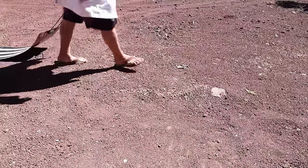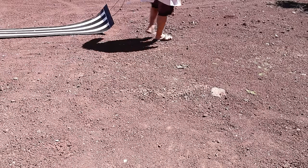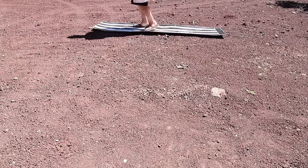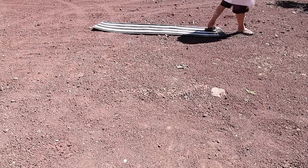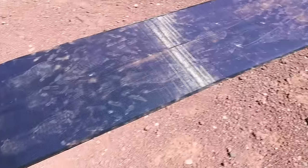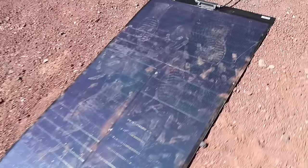Let's do some real damage — I'm going to flip it over on this gravel and drag it, pretty much destroying the surface. If you would do this to a regular flex panel — let alone a glass panel — it definitely wouldn't survive. I'm on heavy gravel, stomping all over it, seriously damaging the surface. I think I just simulated about 10 years' worth of damage. Look at the surface — it is wrecked, seriously scratched up. Riddled with bullet holes, scratched, walked on, driven on, stepped on heavy gravel. Let's see what the output is: 162 watts. It's still outputting almost exactly what it did at the beginning, which was about 165 watts with the bullet holes.